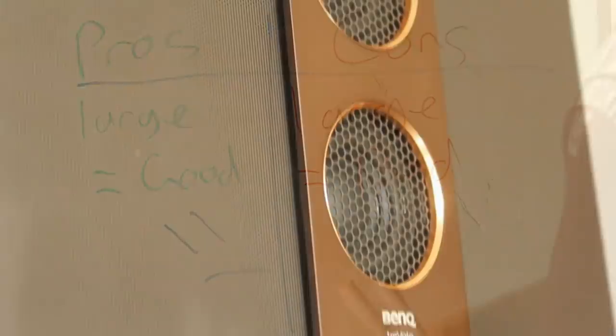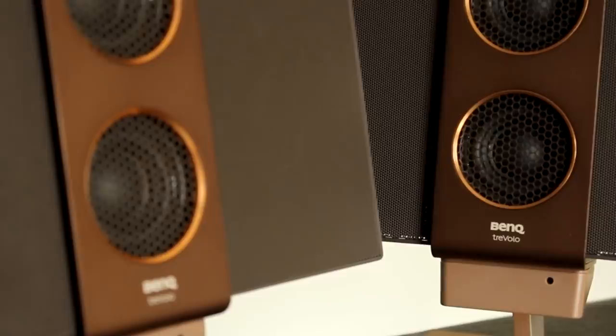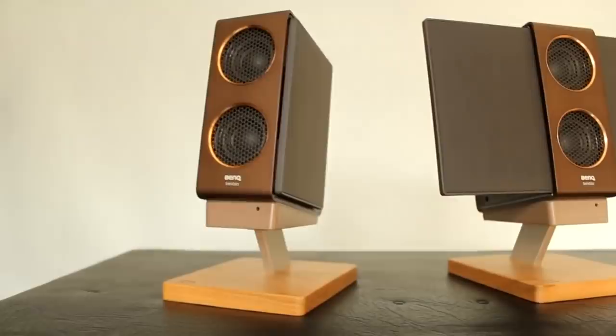So that's given you a quick outline of electrostatics, and now I want you to hear some. These are some of the coolest portable speakers I have seen in a long time. They utilize two electrostatic panels, which cover the upper frequencies, including the important vocal range, where detail and clarity is very important. And as they are fairly small panels, they are reinforced by powerful, accurate bass drivers in an enclosure featuring passive radiators to maximize the output for this size.